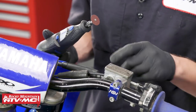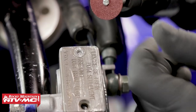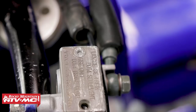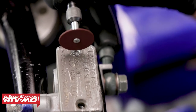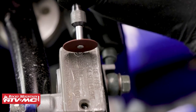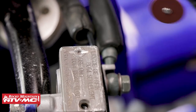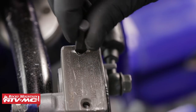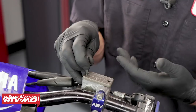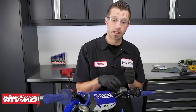We're about to cut into the head of our fastener using a Dremel tool with the smallest cutting disc available. When you cut into it, make sure you're directly in the center of the fastener and only remove enough material for the impact driver bit to fit inside. We are cutting metal, so it's very important to wear safety glasses. After cutting, do a test fit to make sure the bit is going to get a good bite, and make any last-minute adjustments to ensure a solid grip with the tool.